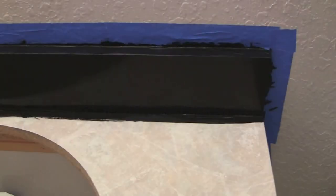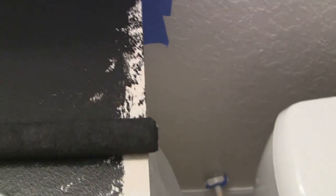Once that's all done, we get a scouring pad and rough up the countertop. After that, we rinse the countertop twice with water and then we're ready to move on. Step two is to prime the countertop. You can see here that we taped along the wall to prevent any primer getting on it. We painted the backsplash first, then did the cut-ins, and now it's just a matter of rolling out the primer onto the surface.